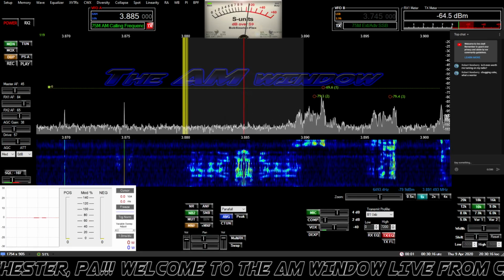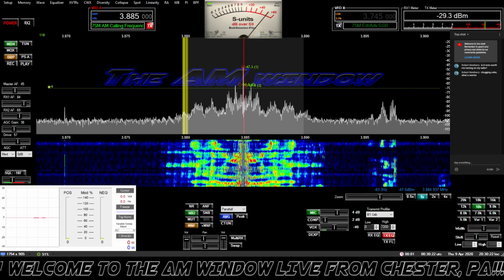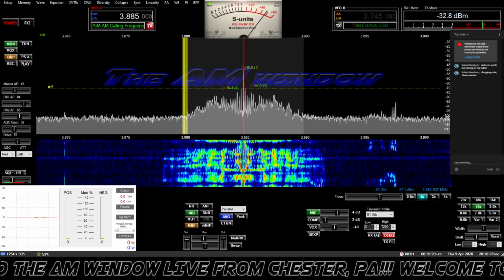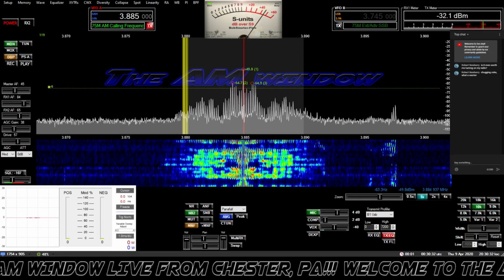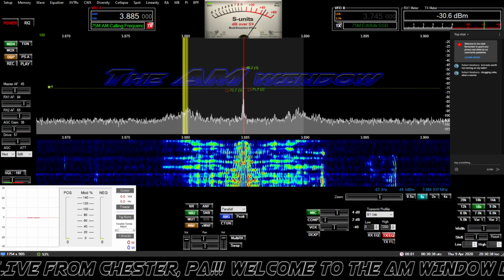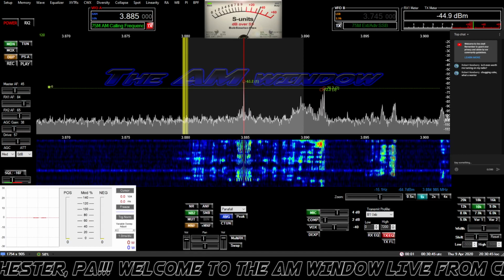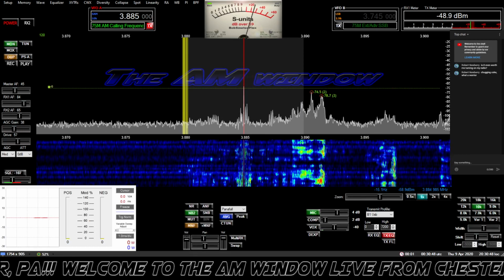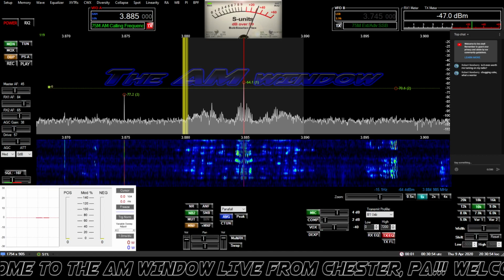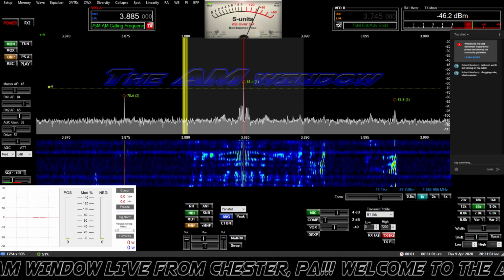It's pretty good. And you have them in an array formation, I noticed as well, for that nice 3 dB uptick. Perfectly. That's the other thing I have to point out, that all of your speakers, the way you have them, oh no, look, I see the other one. They all look like they're on the same plane, so they'll be perfectly in phase. Good stuff. Close as I could, yeah. And actually those 2 in the middle are one single center channel driven by an amp that you can't see. That's in the floor in the basement. That's for the center. I run 5 discrete channels.